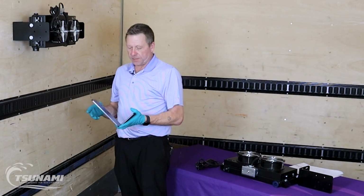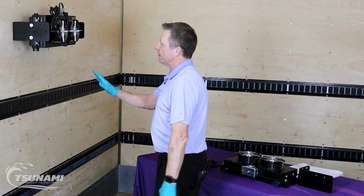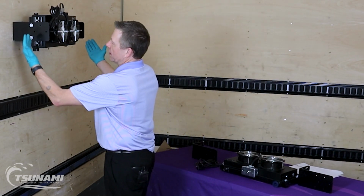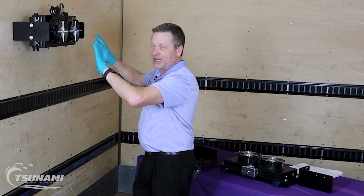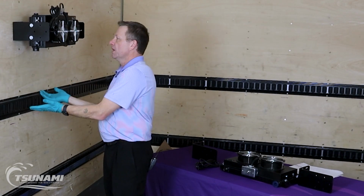What's really unique about this bracket is that when it's mounted to the wall, it has unique mounting patterns, which is going to allow us to either do what you see here, which is mount an Aftercooler parallel to the wall. It's going to allow us to really tuck that Aftercooler up tight, so we have very little space needed. If we have to, we can mount it up a little bit higher. We're still getting airflow drawn in from all over to pull it up.